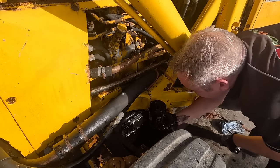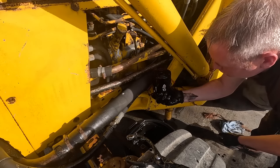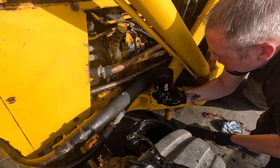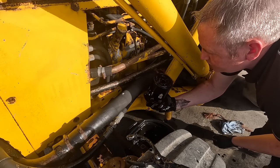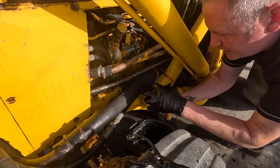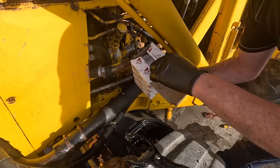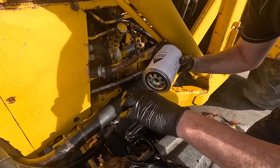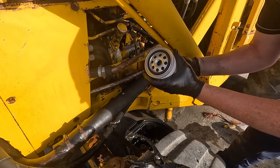Covered in oil doesn't make them any handier, but they are handy. That filter you're looking at there — there is a bit of oil in it, not much, but it weighs a ton. Well, not literally a ton, but it's far heavier than it should be, so it's obviously full of dirt. Look at the top of it. Anyway, we're going to replace it like for like. Normally I'd rub the two filters together, but because that stuff looks like pure tar, I'm going to put some fresh oil on the new one.